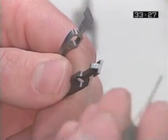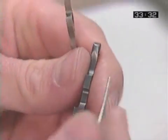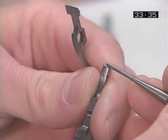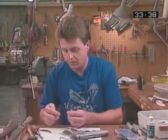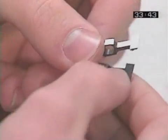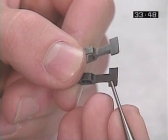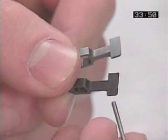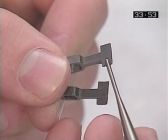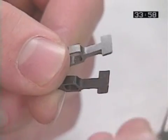And they'll have them up on top. They'll basically run the complete length of the disconnector, right over the top and down the other side. And what you need to do is, on this surface here, you need to polish this out. It may take a file to get the worst part out. And then once you get the worst of it out, you can just take a polishing stick and polish it till it's nice and flat and nice and smooth. You don't want to remove any more material than you have to. Right, so you're really just polishing out the burrs and the ridges.